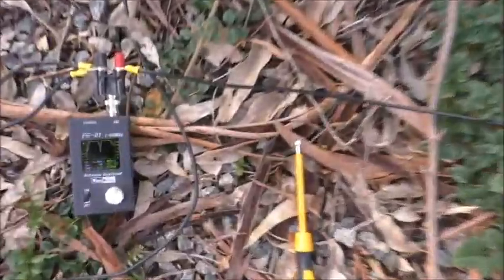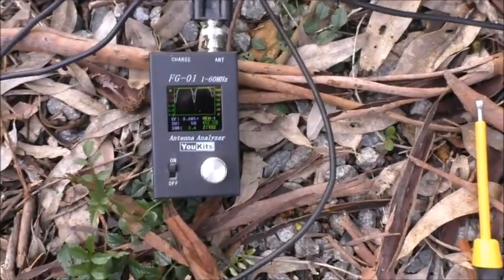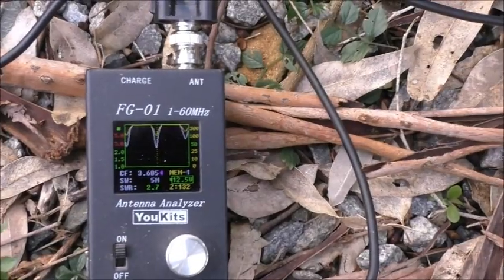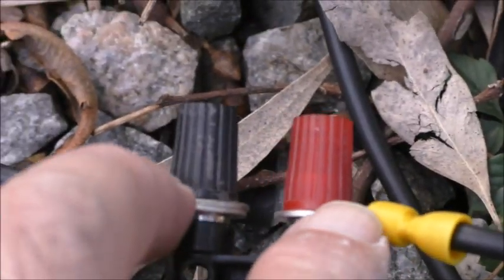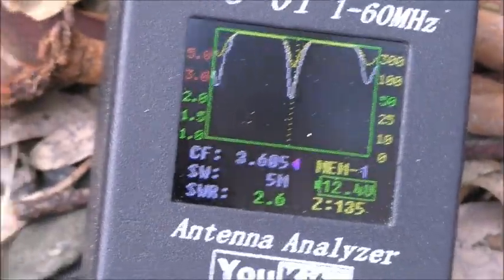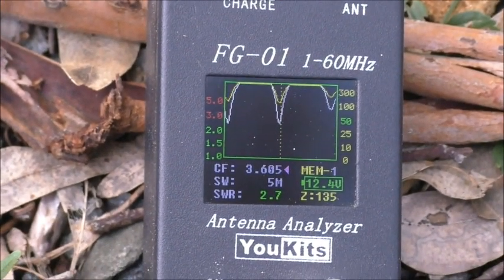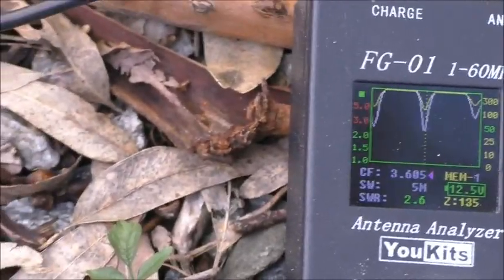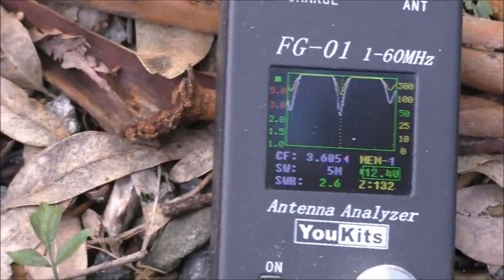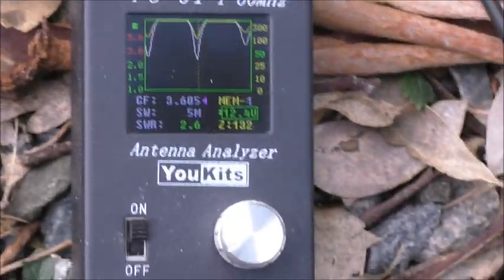Just by putting that extra length of wire at the feed point of the antenna, I saved myself from taking all the antenna down, and it makes it very easy to put the antenna back exactly as it was. The antenna wire and extension wire each have a crimp lug, so I just bolted them together to extend the wire. If I wanted to change it back I can just undo the bolt and take the extra bit out. I don't think I will though, because I've been getting very good reports since I changed it. I may still play around with it to get it working well on other bands too, since there's no nice sweet spot sitting over 7.2 or 1.8 MHz, which is peculiar. Okay, I hope you found that interesting — as always.